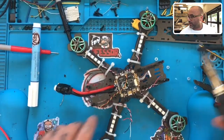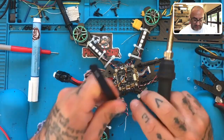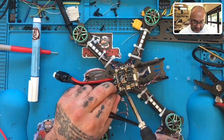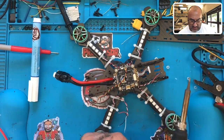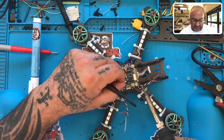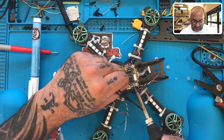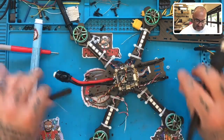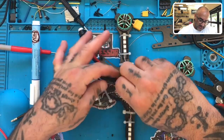And if you're noticing by now, if you have one of these boards or get to look at it, the squares are always gonna be the 5. So we have 5 ground LED. And then over here, we have LED ground and 5, so LED ground and 5 volt. Okay, now, again, these wires are long. Let's go ahead and just kind of get it up there.